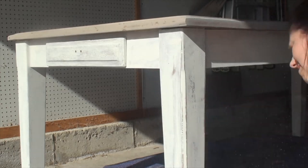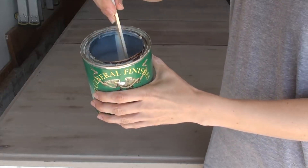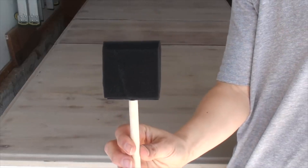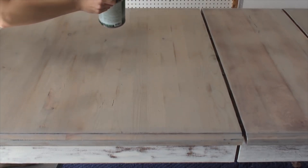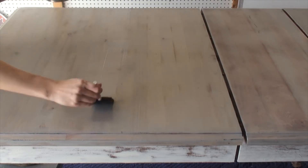This is my personal kitchen table and I wanted a very chalky finish on the apron, so I did not seal the chalk paint. But I did seal the top because it's our kitchen table and we eat at it every day, so I sealed it with General Finishes High Performance Flat. This is a very old video — they don't sell this in the green can anymore, it comes in a blue can — but this is one of the top coats I used to use all the time, and I apply it with a foam brush.